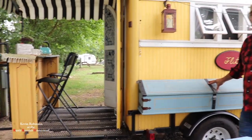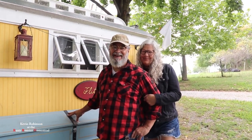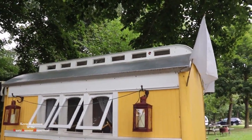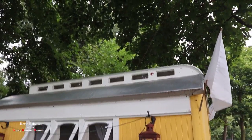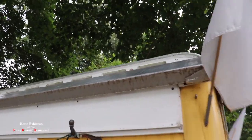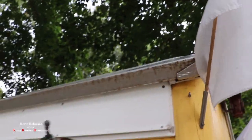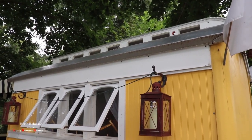I can see mama's in there — this is why I built the camper. Mama ain't having a tent! I don't blame her. Now I was noticing your roof — this is one of the main things some people may have trouble with. What is this stuff on your roof? That's a product called Peel and Seal. It's a commercial roofing product that comes in three-foot widths and a hundred-foot length, for low-pitched roofs. It's got a wax paper backing — you put it in place, peel the wax paper off, and you better have it where you want it because it's not coming back up.